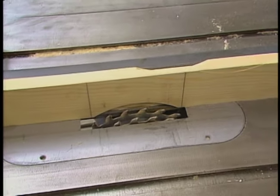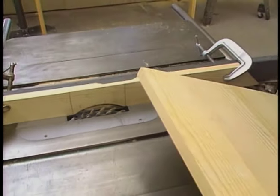Now I'll do that on the table saw with the dado head set in place and a piece of wood here to protect the blade from the metal fence. And I've put 2 marks here which are indicators which will show me where to start and stop so that I'll get that 3/4 inch remaining on the front of the piece.